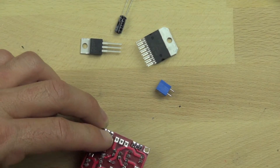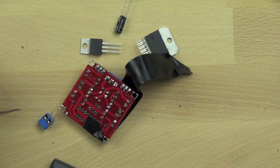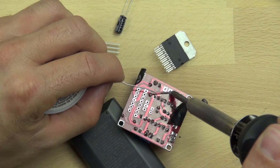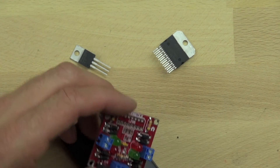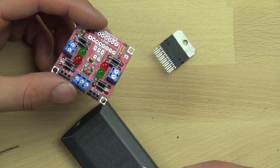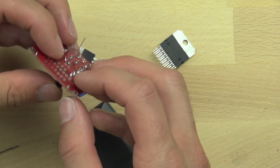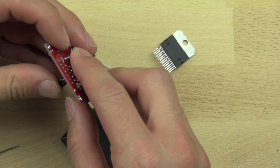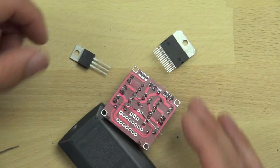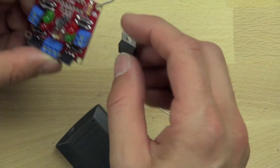We've got a place to wire our battery — that's our three-terminal block — and then our motors are wired on the two-terminal blocks. We tape those down to make sure they sit flush, since they tend to fall out of the board when soldering. Next is an electrolytic capacitor: a 22 microfarad, 50 volt capacitor. The round pad needs to be connected with the positive lead, which is the longer capacitor lead. It is polarized.